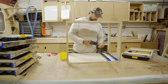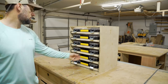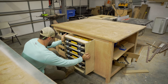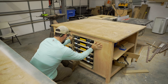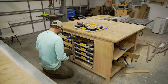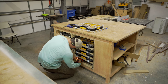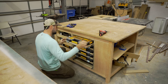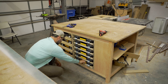I'm not adding a back piece to this cabinet because I'm not worried about racking — this cabinet is the definition of a perfect fit. It's going into this outfeed table where I left the space when I originally built it to be modular. If I don't like where these drawers are, I can take both cabinets out and move them somewhere else in my shop. One reason I didn't glue the half-inch pieces to the drawer bottoms is I'm mildly worried about their strength — if they don't hold up over time, I'll come back and add full sheets of half-inch with glue and screws.